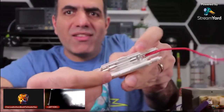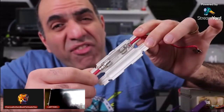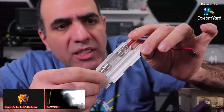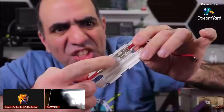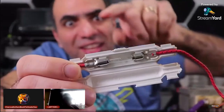No, look at it. There is a more regular looking fuse inside the plastic cover. It is a 5,000 volts, 0.7 amps fuse. From my extensive experience with high voltage fuses, the gap doesn't look far enough to avoid big arcs. Let's try it out. But this is interesting.